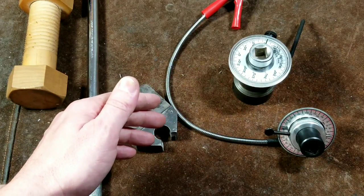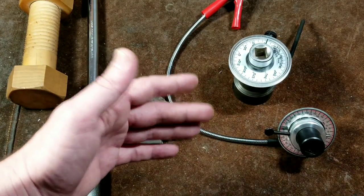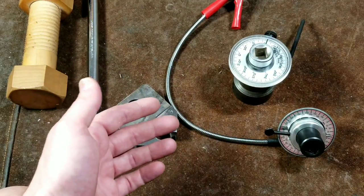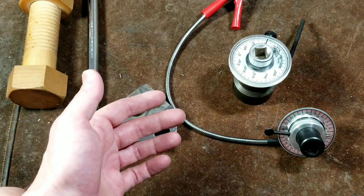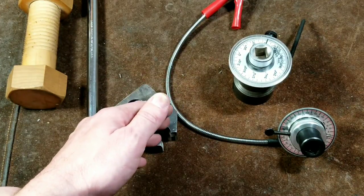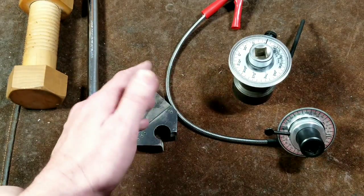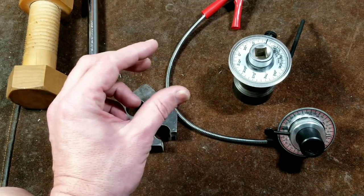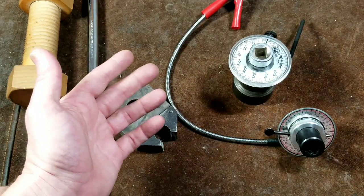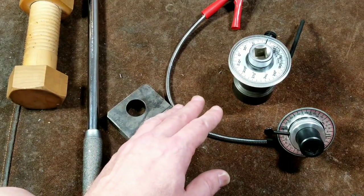At lower values, traditional torque wrenches are much more accurate, really. At high torque values, more of that torque is being applied to friction rather than actual clamping force on the fastener. So you torque to a low value using a traditional click type first — making sure that if the bolt's caught up on a burr in the threads or you have a gasket that needs to cinch down before the final torque, the minimal value handles that. Then you use the torque angle meter to provide the final cinching.